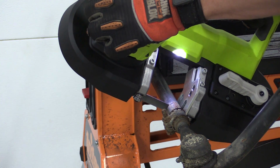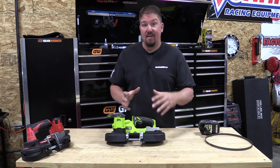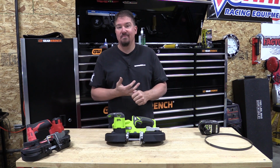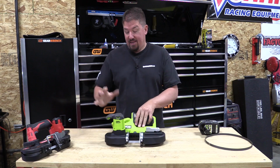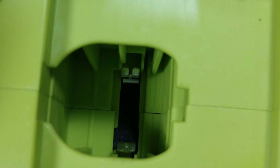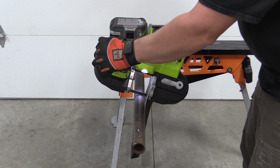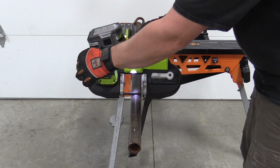You always want to make sure that you're cutting steel where you can get the most teeth on the metal or plastic that you can. So make sure that's right. Use some safety glasses, wear some gloves, either way. But this is a brushed motor, and you can tell that it does not have more than 2 connections on the inside, so using your higher capacity batteries is not going to give you any more power per se, like it would in the other brushless tools.